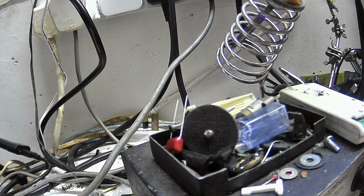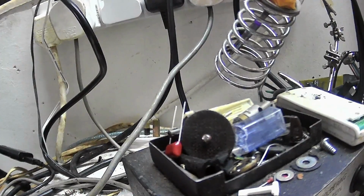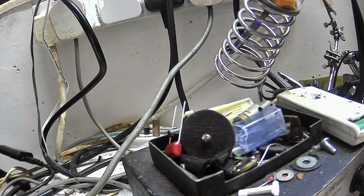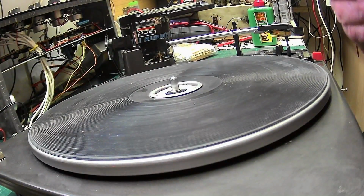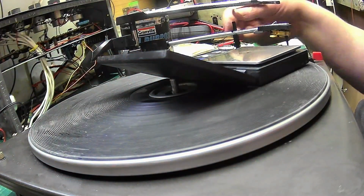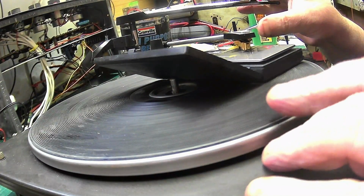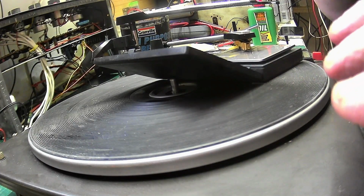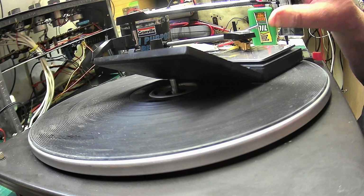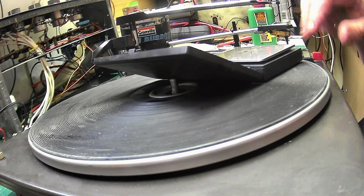And we'll actually check the stylus pressure. Just get the stylus. Get the scales, the stylus scales out. And we'll have a look. I said 4 grams, yeah? Let's see how right I actually am. I said 4 grams. I've got a dot right in the middle of this. I said 4 grams. Or did I say 5? It's actually 3.47. So, yeah, but by the time we're down there, it'll be about 4 grams. So 4 grams, which is what this cartridge needs to see.